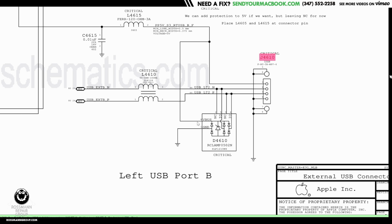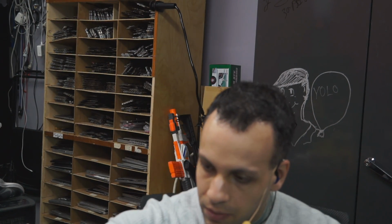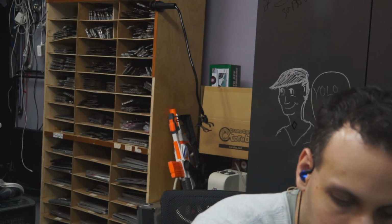Now, people would say, how do you know that it's the coil versus the port? Why wouldn't you measure it with an oscilloscope and look at the waveforms? And it's like, dude, you're overcomplicating it. This component costs cents. You can get it off of a donor board. And if you're at all proficient with soldering, that takes, what, all of 90 seconds to replace? And it's something that I replaced very quickly. It's easier to do that than it is to lug out the oscilloscope. Not kidding. Lugging out the oscilloscope will take me more time. Then I have to set up and put it on the bench. And then I have to use brain power. Does that look like a working USB signal or not?